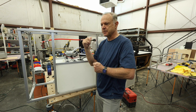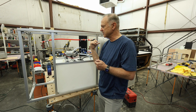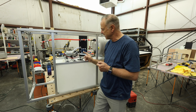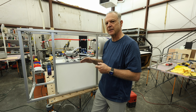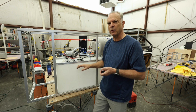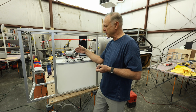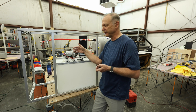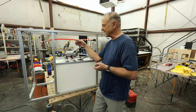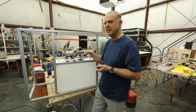You can also just pour your antifreeze right into the tank, and I'll show you in a minute where we can do that. If you pour it into the tank, you need to use a little bit more because you've got to get it up to a level where this tube can pick it up and then pump it through the system. And then when you go to flush your system out, you've got to fill this with water and run it until the antifreeze is flushed out. If you only run it through the pump and into the system, it's a lot easier to flush it out because the antifreeze is only from the pump on, and it's easy to flush that out. So we prefer hooking it up to here, but it is easier just to dump the antifreeze right into the tank.